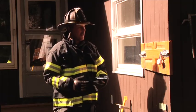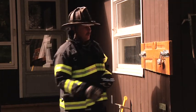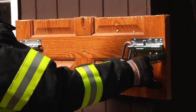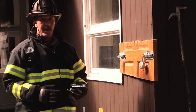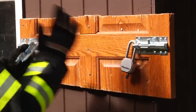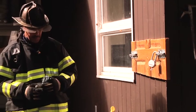Many times when we come up to these things, we focus on attacking the lock. One of the reasons we look there is because we have 4 attachment points on the top and the bottom. So that's 8 times we might have to shear something if there's carriage bolts. So we focus right here. The makeup of this is fairly easy, okay?